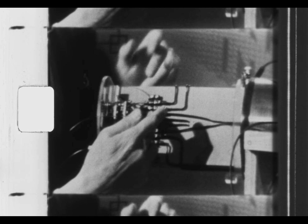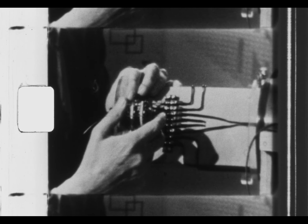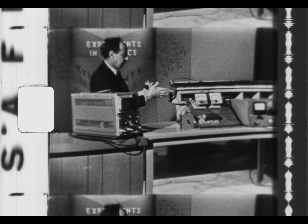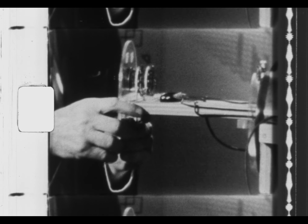The leads all come out to these terminals. You can then follow them through the selector switch and see which is connected from the little contacts on the selector switch to the slide contacts which connect to these two terminals here, and they go to the scope. There are markings on the front here which sometimes get displaced, but which show which coil is connected — though I would certainly check the wiring to make sure you know what's happening. When this is on the very flat coil which is in the median plane, you can check whether it's on the median plane by raising and lowering it very slightly and taking readings at various positions to see if that has any effect.